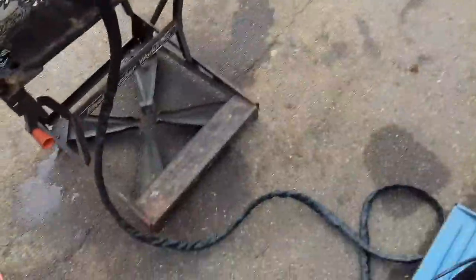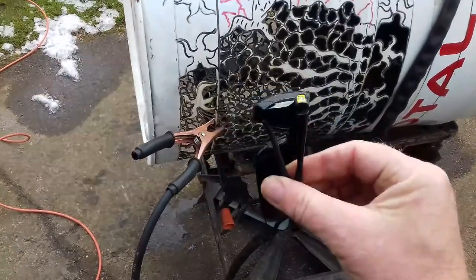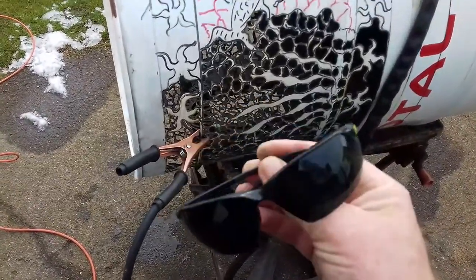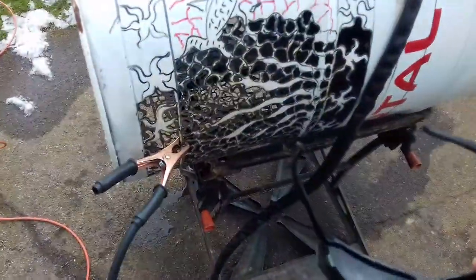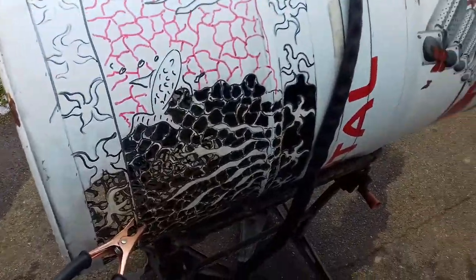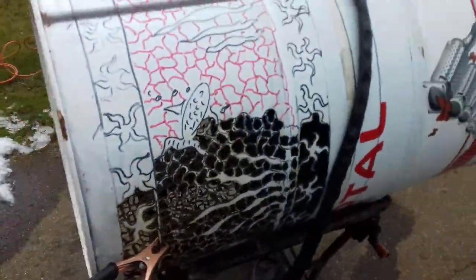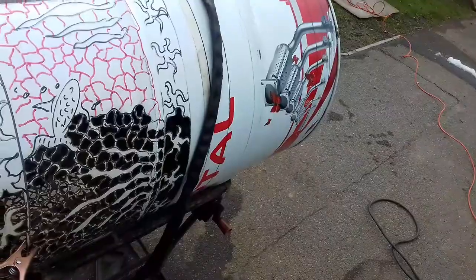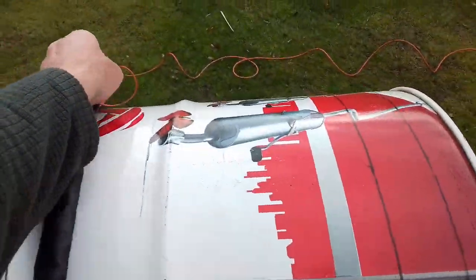Connect your earth, compressor on, turn on. Now these aren't sunglasses — these are gas cutting glasses, I think they were about eight quid on eBay. You can wear goggles or your arc masks but you have to turn it down so you can see what you're doing. I wear ear defenders because I suffer with tinnitus, and the sound of the air really bugs my ears up. I'll try and hold the phone and do a cut to show you how easy it is.